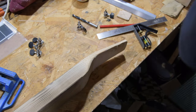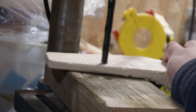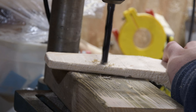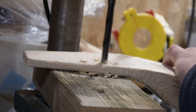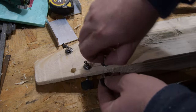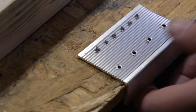One of the only things I've actually bought for this project were the tuning pegs. I've marked out where they need to go on the neck and now I just need to drill the holes. I'm going slow — I don't want to tear out the wood and I don't want any mistakes, as wonky tuning pegs would show up badly. Once the holes are drilled I'll build it up to check everything fits, then disassemble and paint. My goal was not to use any 3D printing, but I do break that rule a little.